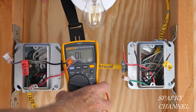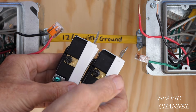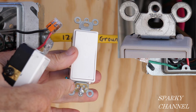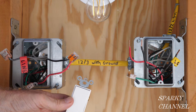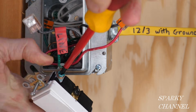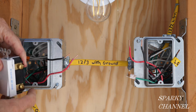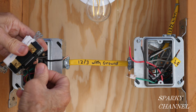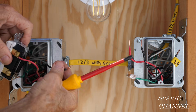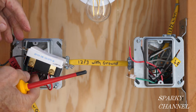These are the two three-way switches. Both switches have two bronze traveler terminals and a black common terminal — it's important you put them the right way up; it says 'top' right here, and at the bottom there's a self-grounding clip. I like to crimp the wire around the terminal and then tighten it down well. I'll secure the ground wire first, then take the traveler wires. It's my preference to put the red traveler wire on the top terminal — I'll do that for both switches. The red traveler wire is secured, and now the black traveler wire is nicely secured.